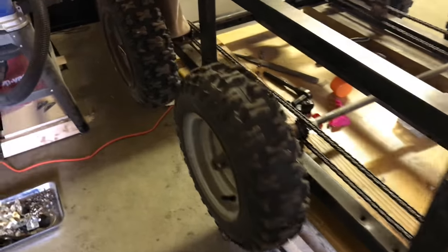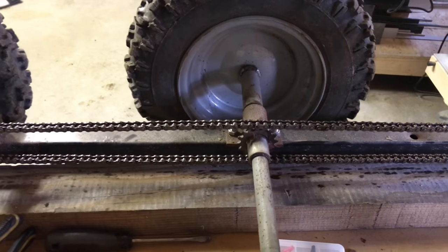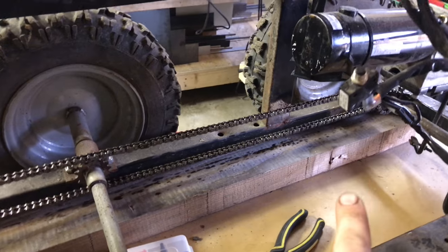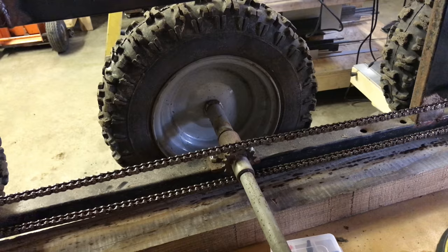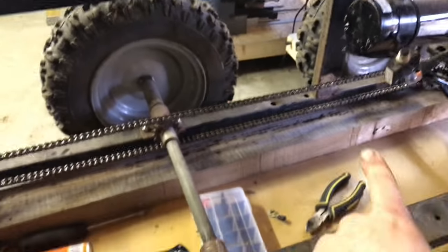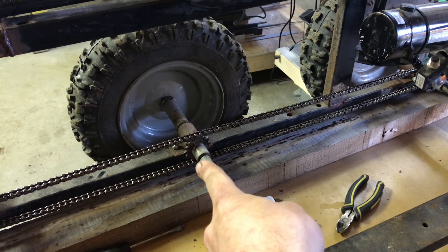It's got six snowblower wheels chain driven together. There are a few flaws with it already I can tell. For example, having one chain running right from back to front, just skimming over the middle — that's never going to work, it's going to constantly skip. You need one chain that runs front to middle, and then an additional chain and sprocket that runs middle to rear.